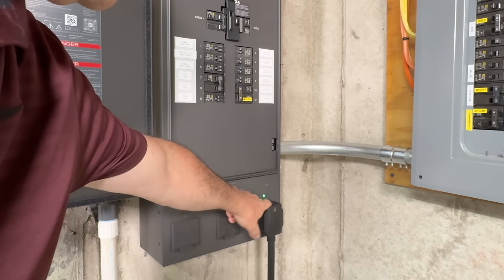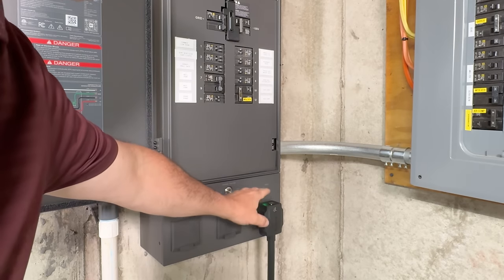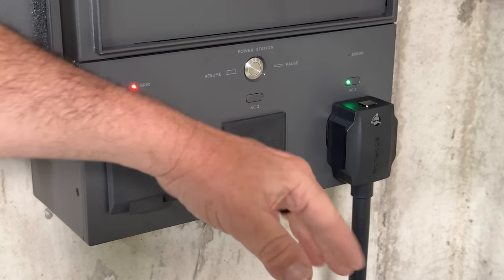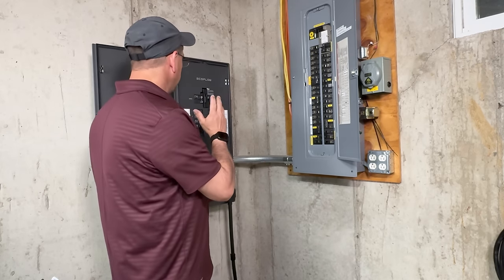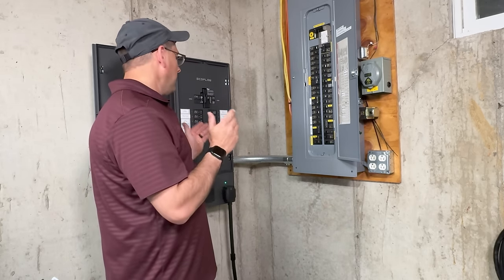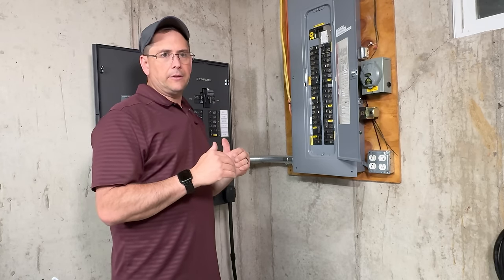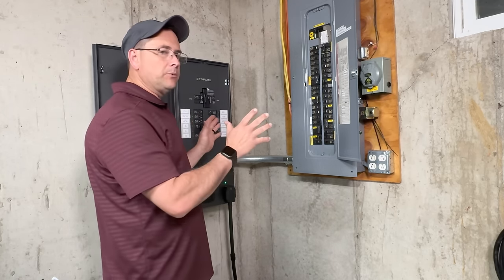Down here we have a green light — that is a diagnostic light. It will blink red, blink green, or solid, and you've got a set of codes that go along with that. Over here we have the grid light, which is red, telling you that the grid is dead. And you have an emergency power station switch here which, if you hit it, disconnects everything from the transfer switch and kills everything. One thing to keep in mind: when this thing is to be installed, EcoFlow wants you to have a licensed certified electrician to install it so that everything is done to code, permits are pulled if needed, and you don't have to find out later that you did something wrong.